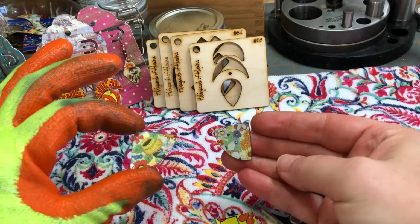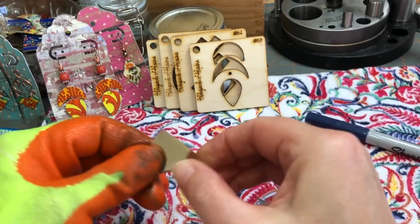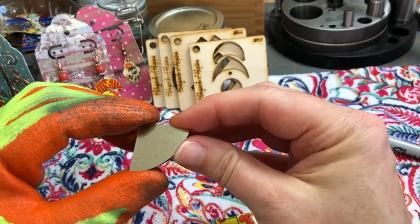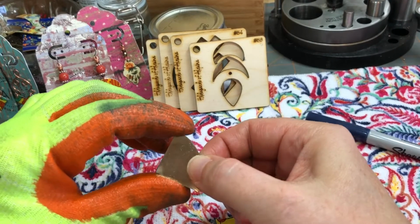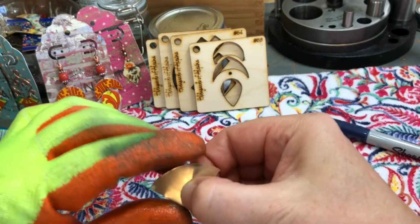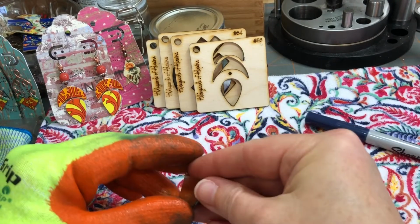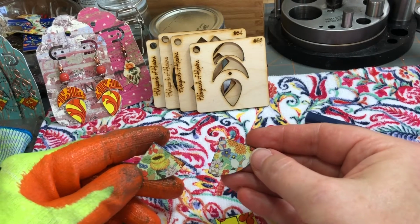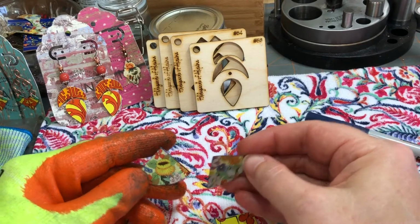So if we want to see how well we've cut, we can put right sides together, flatten it out, and then if you can see metal behind, you need to trim, and we're pretty good. All right, so we've got those done. Okay, so trick on curved, well, on all shapes, but especially curved, move your metal, not your shears.